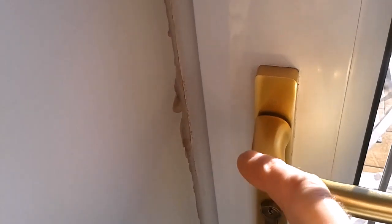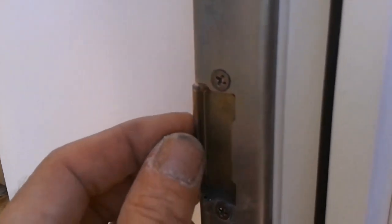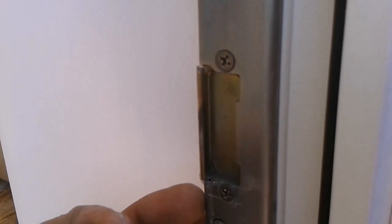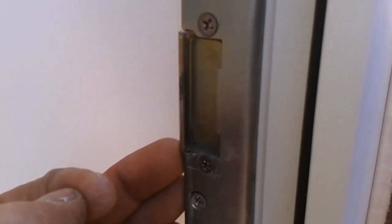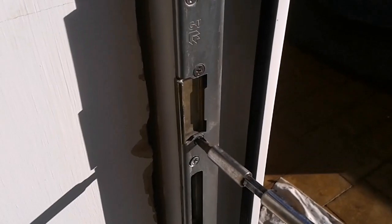Also, there's a lot of movement at this end of the door. Hear the traffic noise there. And I'm going to close it. So there'll be a plate down here near the receiver where I need to adjust. This little plate here. Get some light on it. These two screws, need to undo those and just take this back toward the frame, a millimetre or two. I'll just undo the screws. I'm not going to have to take them out, just slacken them off.